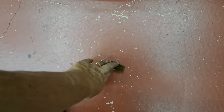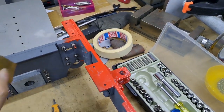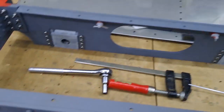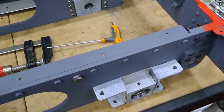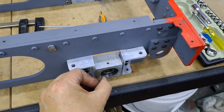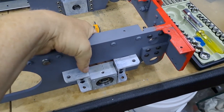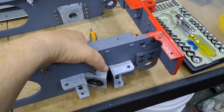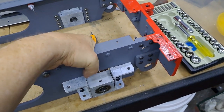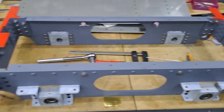I'm just looking for my piece of brass - there it is. Nice and easy setup. I used the shim towards the back every time, because I know that the front horn cheeks are all set to correct distances - so put the shim in at the back, and nice and easy, no worries. They were a little tight, but by putting that in and taking it out it gives me five-thou clearance. I used brass because I knew I had it here in the workshop - but you could cut a piece out of a Pepsi can or Coke can - no sponsorship involved, not sponsored, don't go thinking anything like that.